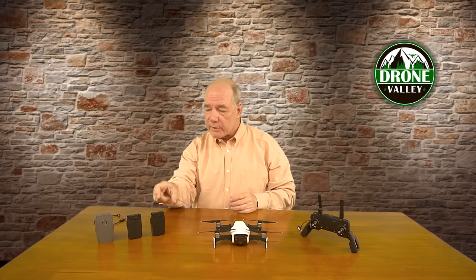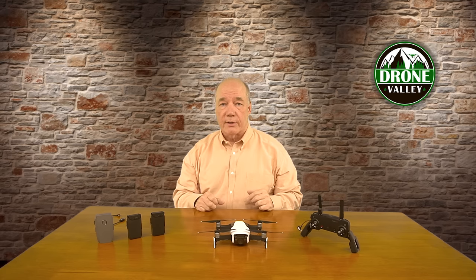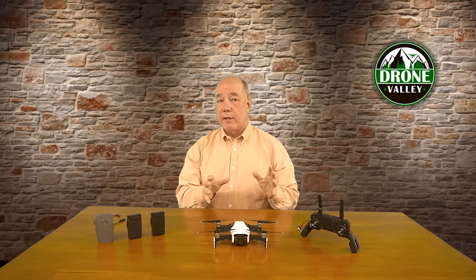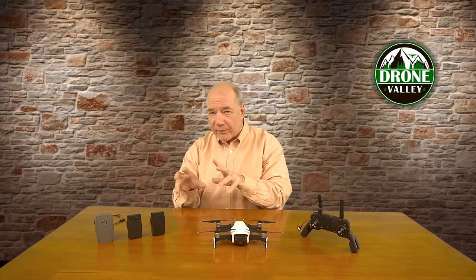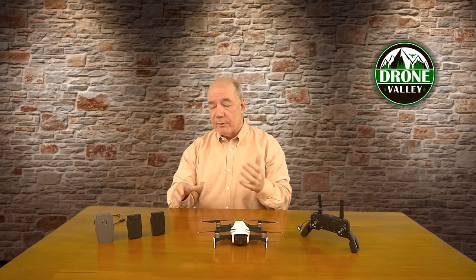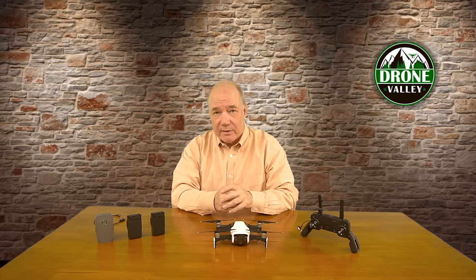Inside the battery there's an intelligent circuit — a controller — monitoring the LiPo cells and controlling the current for charging and discharging, balancing the charge across all cells, and checking temperature and abnormalities. It reports that to your drone, which reports it back to you through the app. If you ever get a battery error while flying, land immediately. The danger is if you fly with a compromised battery, you may not get correct voltage or current, and strange things can happen — it may impact GPS, the IMU, or the compass, which is when flyaways take place.